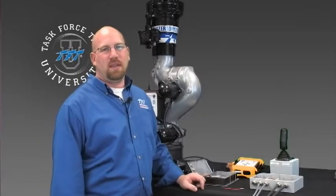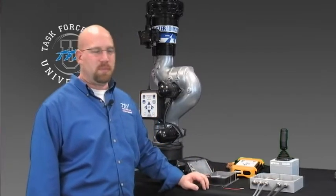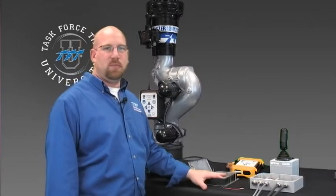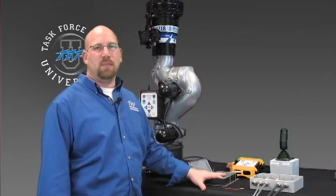We'll often manually test the inputs to determine if toggle switches or something of the sort that are tied into the inputs are the problem, or if the communications between here and the monitor is what's causing the problem. Having just tested all these inputs and everything working as it should, that will lead us to believe that down the line at the switch or the wiring there may be a problem.